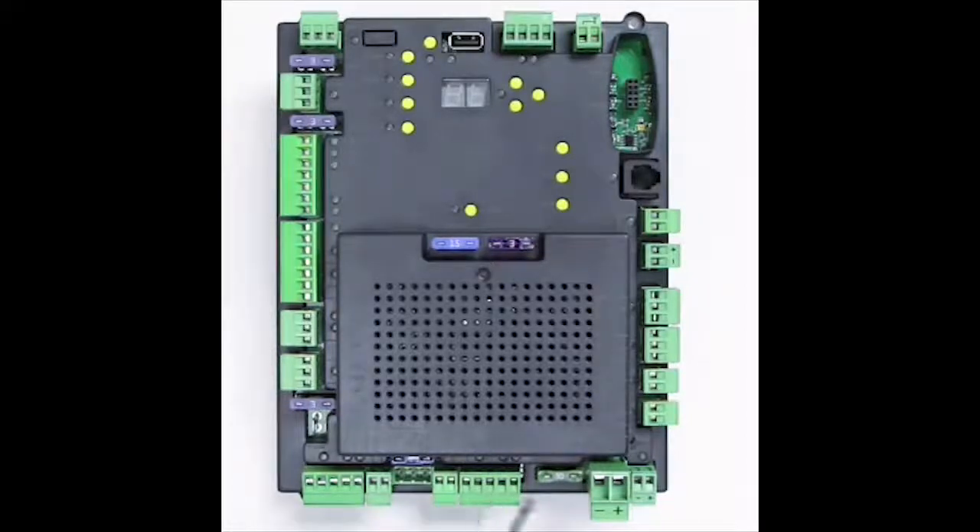This corner handles the power. The battery port, fused and rated for 30 amps, is integrated with a regulated charging circuit which receives its charging from this solar port. Each of these ports has its own LED indicator to ensure proper polarity.